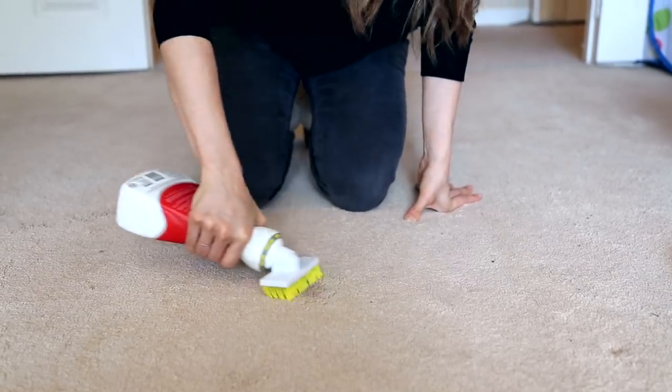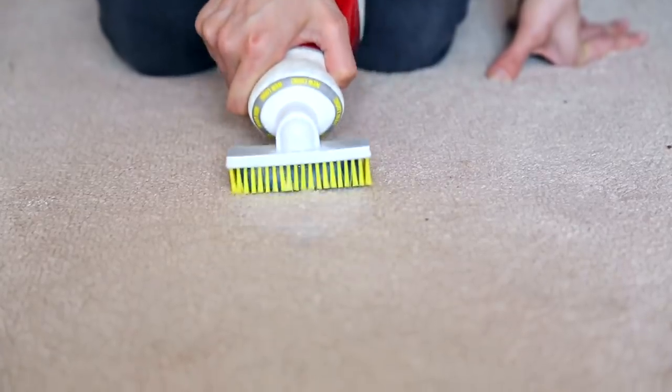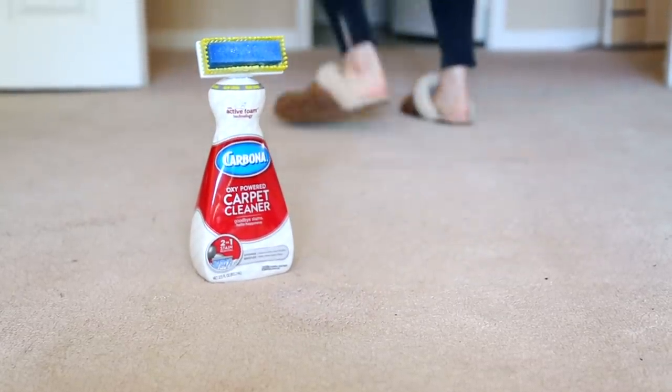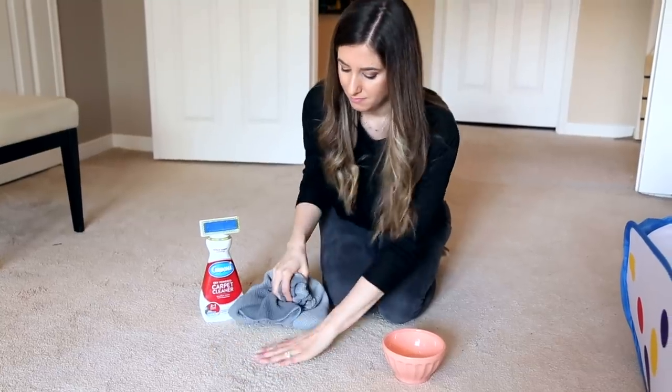To use it, I'll just squeeze gently to moisten the brush and then work the brush and the bristles into the stained area. Make sure that you don't soak it — the right amount of product is really important here. Then I'm going to let it sit for about three minutes and remove excess product with a clean, damp, colorfast cloth or sponge so I don't have to worry about any dye transfer. Remember, dwell time is so important when it comes to removing carpet stains. You have to apply the product and let it sit — the magic is when you let it work. You also want to make sure that you're testing the product in a hidden area first, just to make sure that the carpet is not going to lose color.